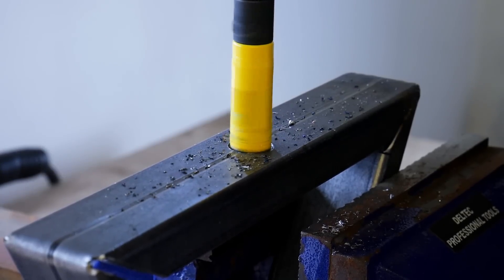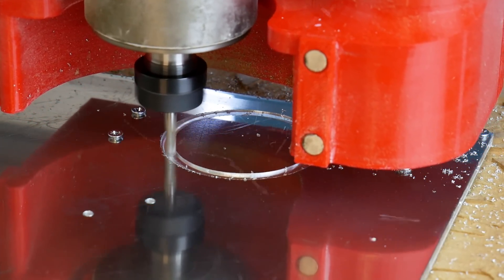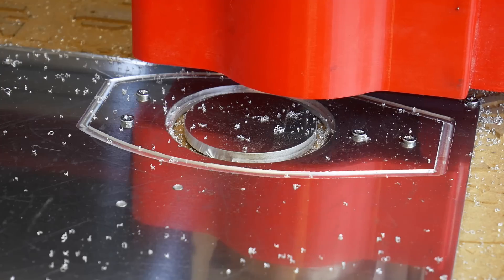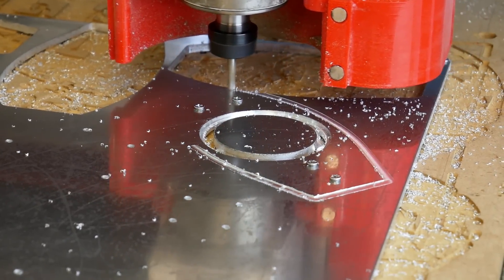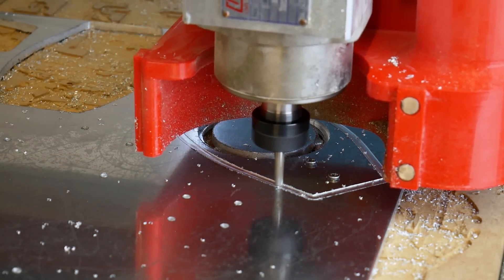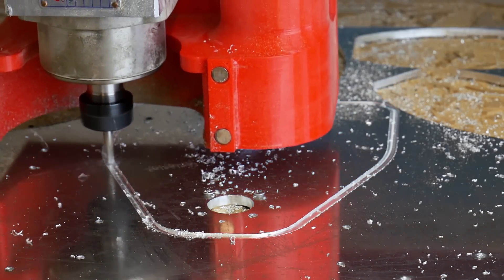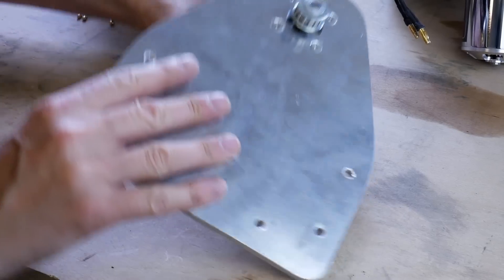There are various big holes and cutouts in this which I'll explain later. First we need to CNC some structural parts, and I'm going to do these in aluminium — 6mm aluminium plate. I managed to find a piece which was half the price of the aluminium I normally buy, however it turned out to be quite soft. The machine only goes down to 8000 rpm and I'm using a 6mm diameter 2-flute cutter, so I had to cut really shallow at only a quarter of a millimetre depth. I couldn't go any deeper at 8000 rpm without it melting, and eventually I sped up the feed rate from around 10mm/s to 50 or 60. That leaves us with the motor mounting plate which is the main chassis for the gearbox that's going to be turning each of the omni wheels.